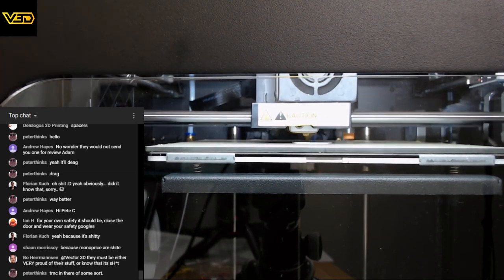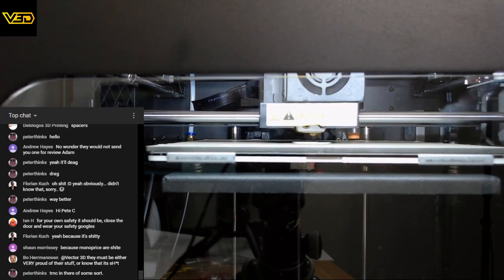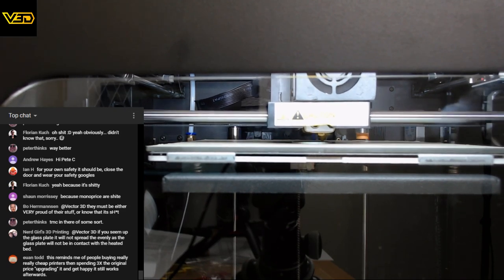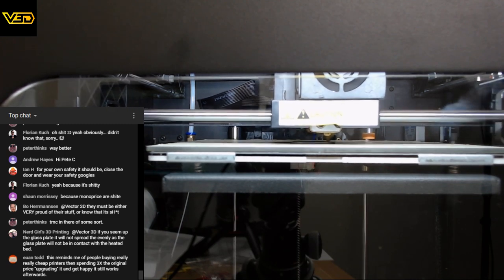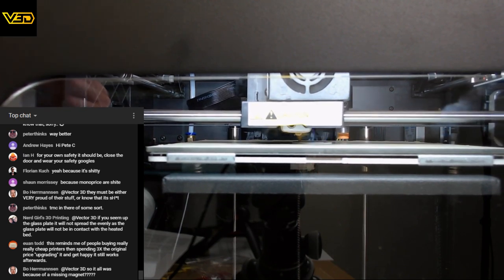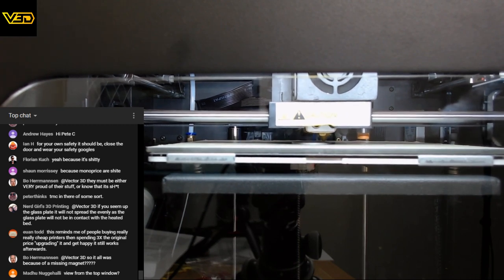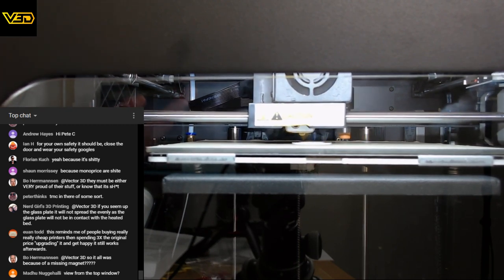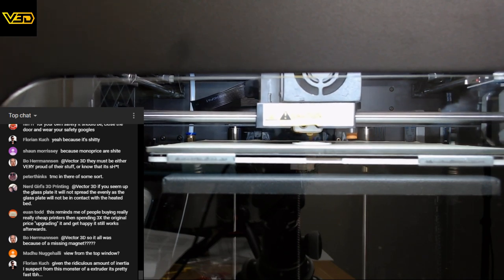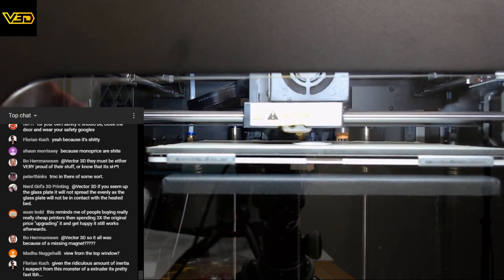The first layer, it's a raft, so... But after raising that bed up, that's absolutely night and day difference. So, because it's printing PLA, the bed is not heating. Obviously, that gap where I put the magnets to space the bed off is a totally useless solution long term, because there's an air gap, so any heat conductivity is going to be absolutely shot. There will be very little heat conductivity between the heater and the actual bed. But for PLA, kind of acceptable-ish.